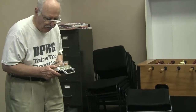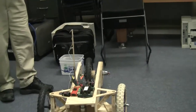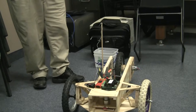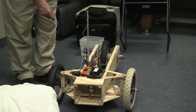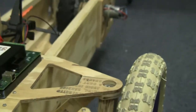You've got a big servo for the steering? Well, that's the problem — it's not a servo, it's just a gear-bound motor, a gear motor. The BEST system had two sizes of motors: a big motor and a small motor. I do have a potentiometer — if you look in there you can see it. See that red? There's a potentiometer in there linked to the steering. What I need to do is close the loop and get myself a position servo. I haven't figured out exactly how to program that yet. Right now you input either through the receiver or through the tether card.